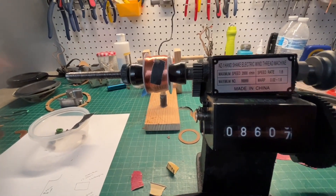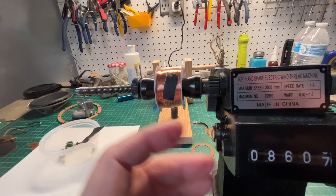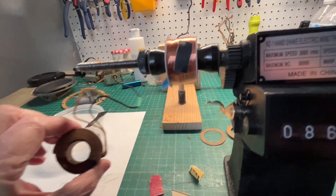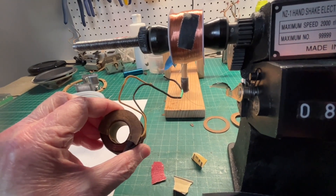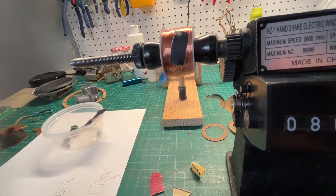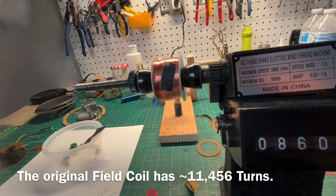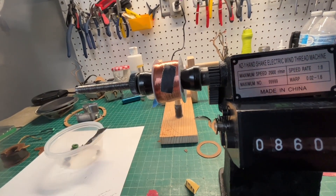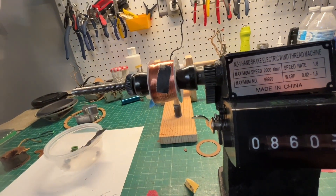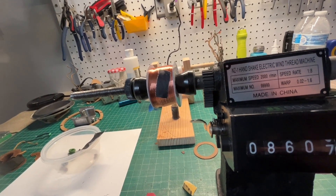I just finished winding the new field coil on the bobbin using 35 AWG. I won't get the same resistance as the old field coil — the original used 38 to 40 AWG wire to achieve 2500 ohms. I'll add a resistor in series with this and hopefully still get enough magnetic energy back to the center pole piece to make the loudspeaker operate.